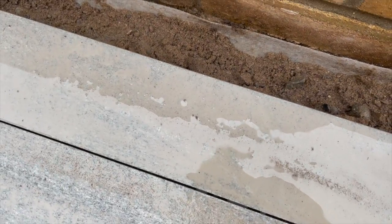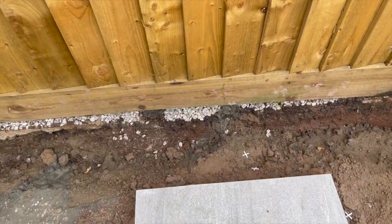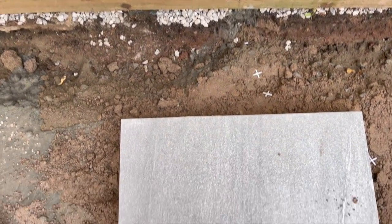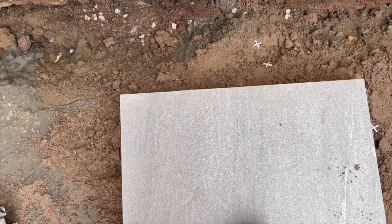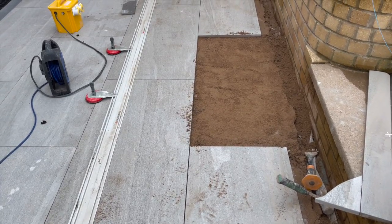We've got these offcuts here, and we need some offcuts for over this side, but what we don't want to be doing is using those other ones, because the grain is going a different way and it will stand out and you will see it. Well, that slab's out. Now to put one in.